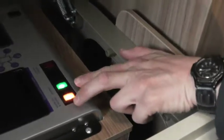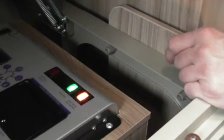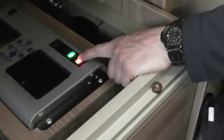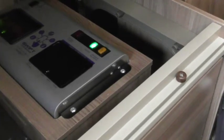This is your consumer unit — it may look similar or slightly different to your last one, but it's the same. They've slightly changed things as well. Heating and hot water — you probably had two buttons before, one for heater and one for water. This one is just one button because we've got one unit that does heating and water now. So if I switch that off and have a look on the heating control panel — on the silver one — you'll see the little plug icon disappear from the top right. If that is not switched on, you've got no electric to heat your boiler.